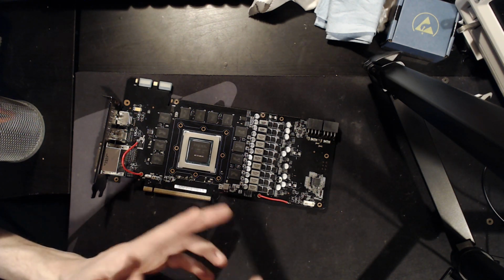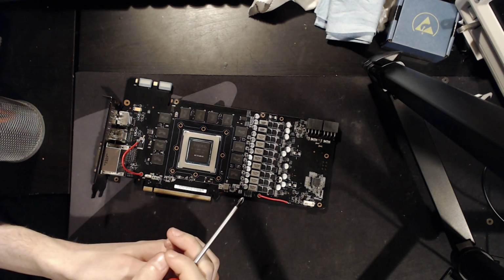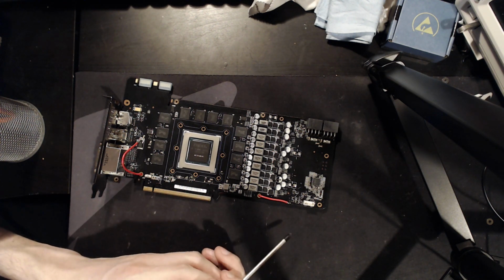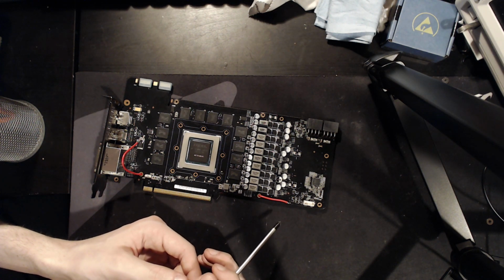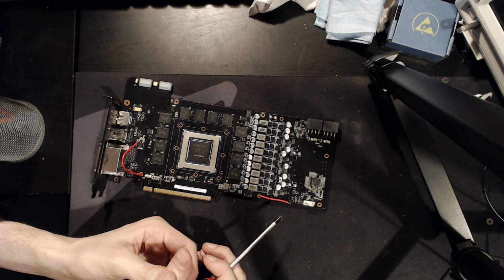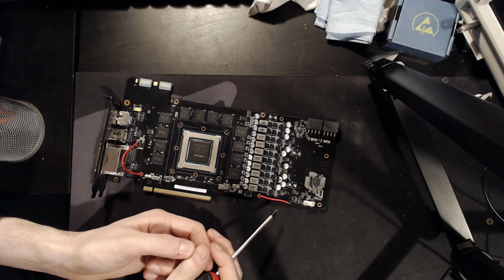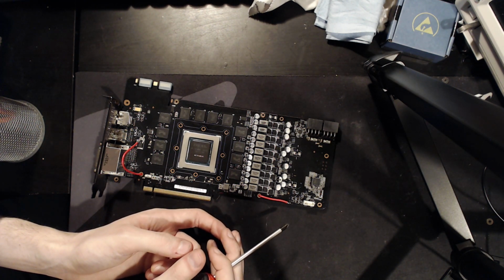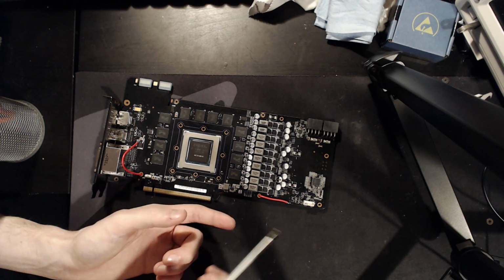I've done it. I've degraded cards to the point where they literally wouldn't turn on anymore because they were just dead. There's a certain GT730 where I decided I had enough of the card and shoved like 2.3 volts into it at like minus 50 degrees Celsius, and it did not work ever again. That's for sure. Very anticlimactic, mind you. Shoving 2.3 volts into a GPU core doesn't make it explode. It just makes it stop working.